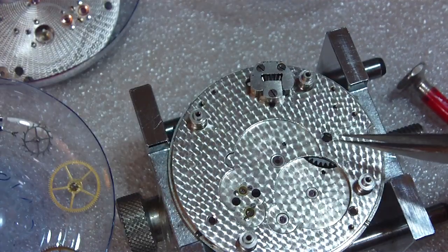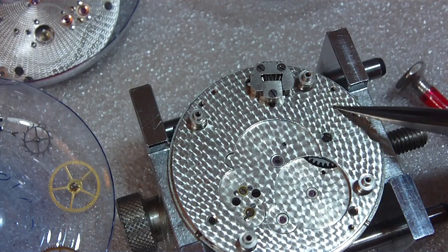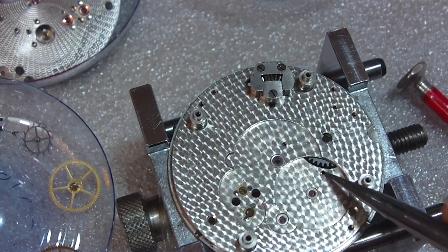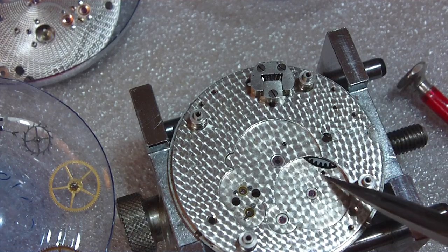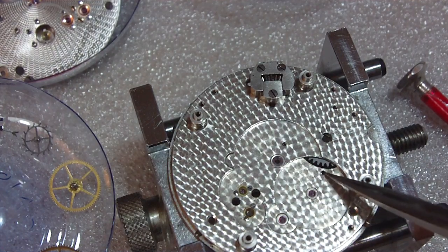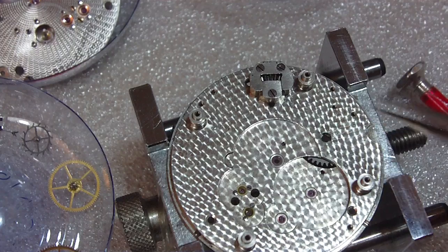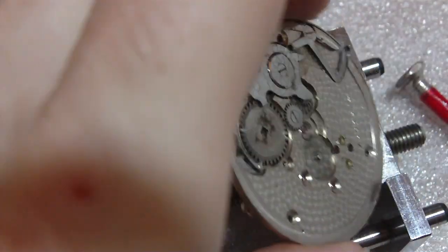Two screws. Yeah. So, the cover for the ratchet wheel: one screw goes here and the other screw goes there. The longer one goes where the material is a lot thinner, because it clears out for the third wheel. So you gotta remember, if you put the long one in there, it's going to bend something or break something. So that's why they did what they did. Okay.